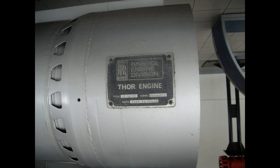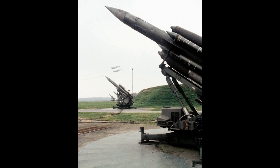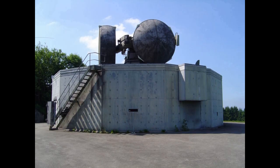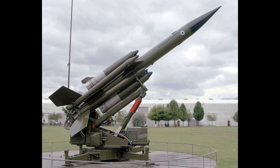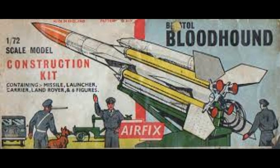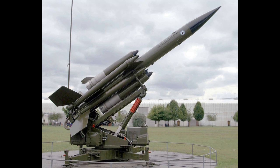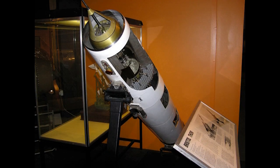Electrical power was provided by a molten salt battery. At room temperature this would be inert and suitable for long-term storage without degradation, but was heated to its working temperature by a pyrotechnic heat source ignited at launch. Although in tests the Bloodhound had executed direct hits on target bombers flying at 50,000 feet (15,000 metres), Mark II production models, in common with many air-to-air and surface-to-air missiles of that period and after, had a proximity-fused continuous rod warhead known as the K-11A-1, designed to destroy attacking aircraft without requiring a direct hit.